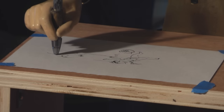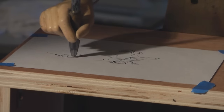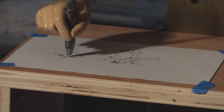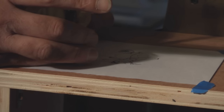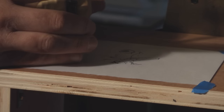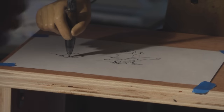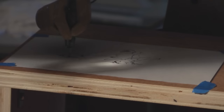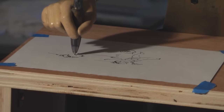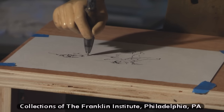There's a cam shift there, and you see now the pen is much too close to the paper, so I have to stop the machine again and adjust the hand. Again, this is because of the compensation spring that needed to be adjusted. But that would have taken maybe another hour and we just didn't have the time, unfortunately. But I was glad that it did sort of show the purpose of that spring, which was a good discovery among many that was had on this day.